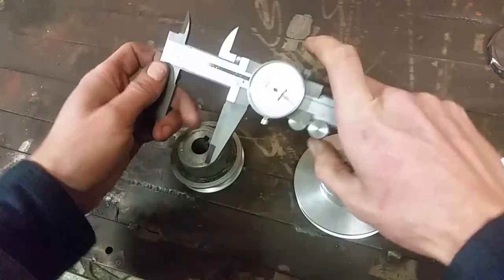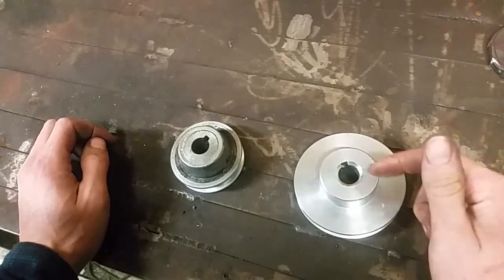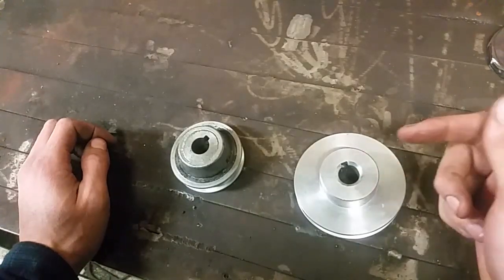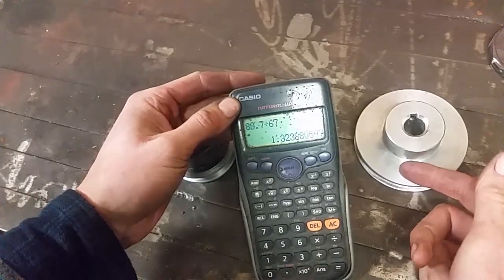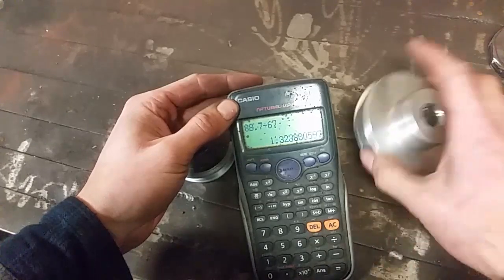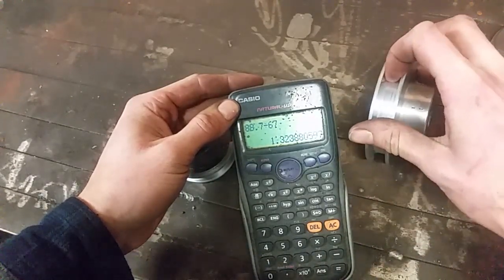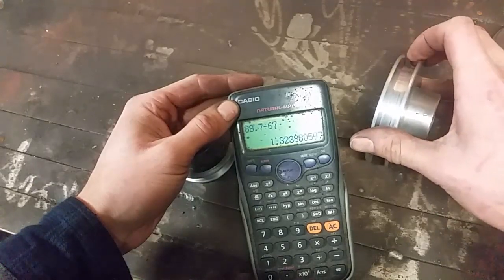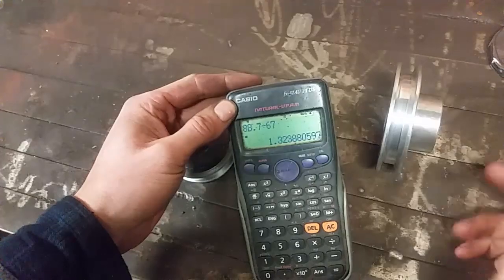So, comparing these diameter for diameter. Mathematically, it turns out this one is approximately 32% faster. Alright, you got me. You should be able to get a 32% speed increase. Alright, I've put a bit of trickery in designing this — I didn't cut this V-groove full width, so the belt actually sits a little bit higher. So I should get a bit more than 32%. Let's find out.